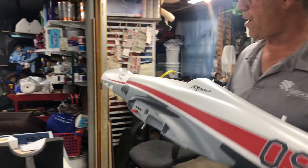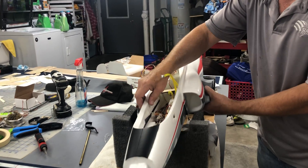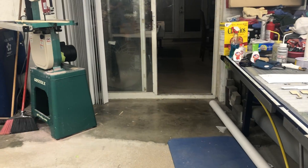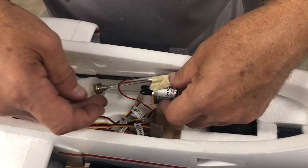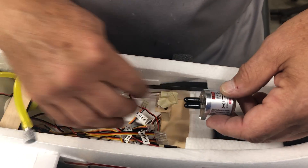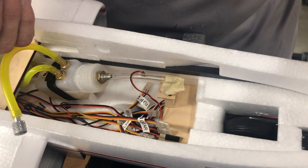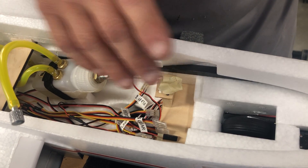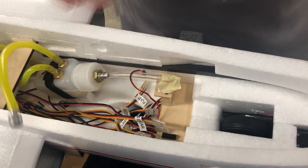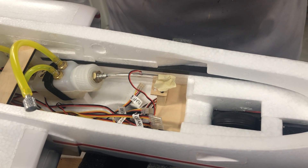Let's talk real quick. I don't supply the pump mount or anything, but I'm going to show you how I do it. There's no right or wrong way to doing this — I just like the pump in a nice relaxed position. Pump's going to go right there. Nice relaxed run between the UAT and the pump — it's not rocket science. I personally like to use my filter and shuttle valve on the pressure side of the pump. I know it's recommended on the suction side, but I've been doing it for two plus years and it's been working fine.